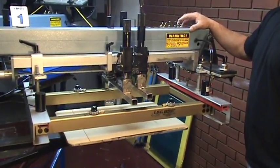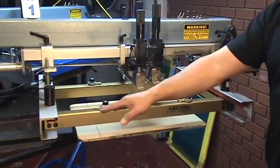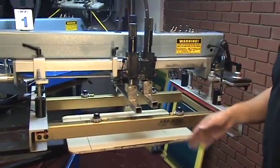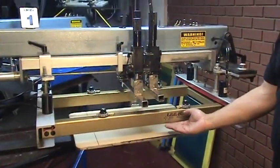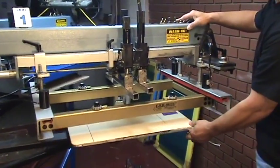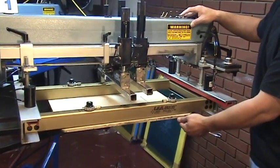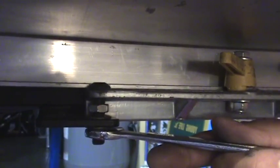Once you've reached the last print station and completed leveling of all the frame holders, the next step is to leave the LOC gauge in the last print station to now set the off-contact on the remaining pallets. Index each remaining pallet under the LOC gauge and adjust the pallet so that the pallet surface contacts all four micrometers, therefore setting the proper off-contact at 90 thousandths. You have now successfully leveled all your frame holders and set the off-contact on all pallets using the LOC gauge.